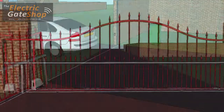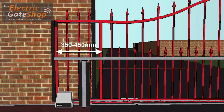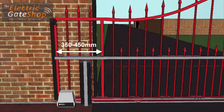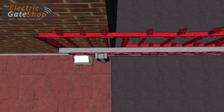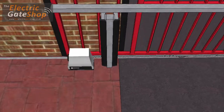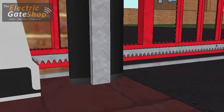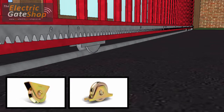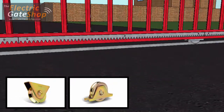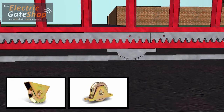Using a floor track, the sliding gate's length should be approximately 350 to 450 mm wider than the width of the opening. This allows room to position the motor behind the wall, away from the opening and support post. Gate rollers are fitted to the bottom of the gate. These are available in surface type that bolt onto the bottom of the gate, and countersunk that are inset into the bottom bar of the gate.